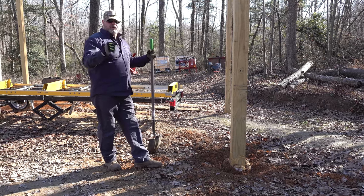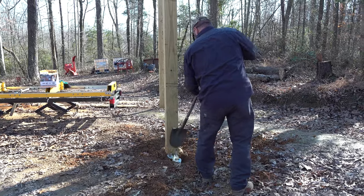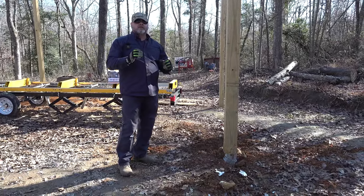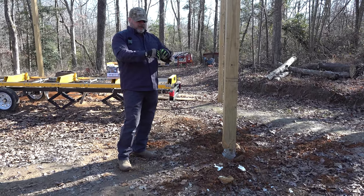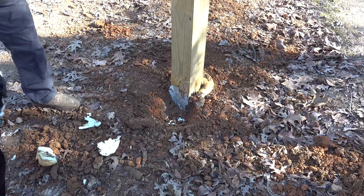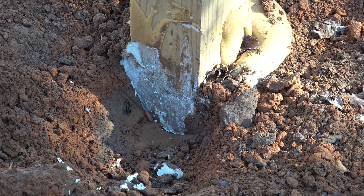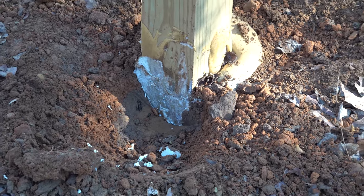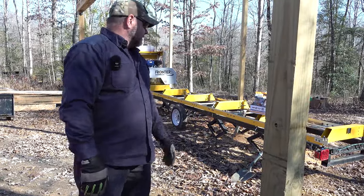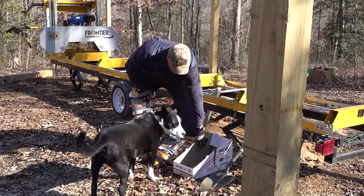When it's got about three to five minutes before it starts expanding - the good thing is once the fluid gets in there, it's going to expand and push around all by itself. Down at the base, when I push the post over, there's a pretty good crack that opens up a void, and it does it on both sides. I'm going to pour the fluid on both sides really fast, then wiggle it back and forth letting the fluid go down in there. We've got three to five minutes, so we'll take the Fast 2K out of the box.